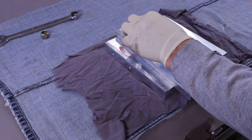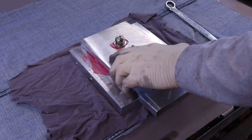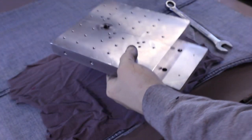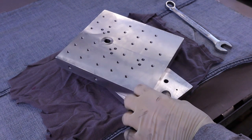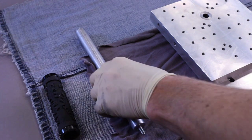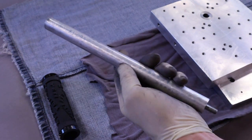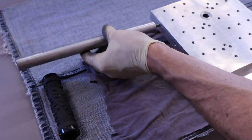With the plates together, the nut can be put on. It needs to be tightened enough to cause drag between the two plates but still rotate. Now some sort of a handle needs to be put on. I use a piece of 7/8 round stock that gets screwed into the side and then put on a bicycle grip.